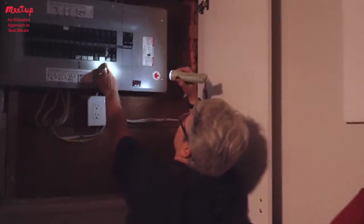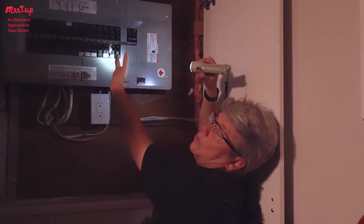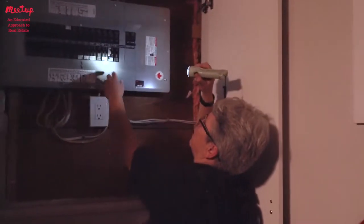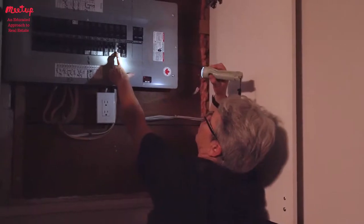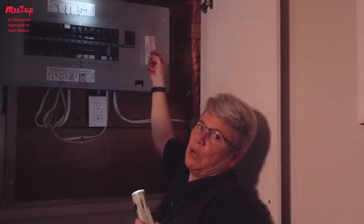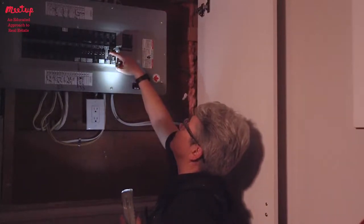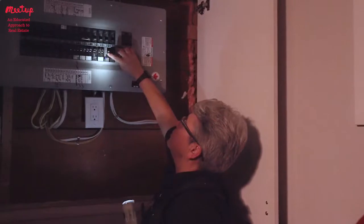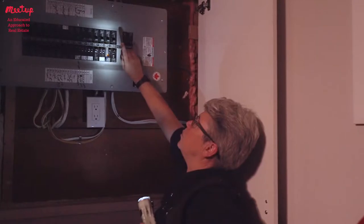You have what's called an arc fault circuit interrupter, or AFCI. This has been installed because work was done on the house — it's been added. It's like a ground fault breaker, but for arcing. If there's a broken wire sparking across a gap, it will shut off. To test it, you press the button, then to reset it you have to go down and then back up — you can't just flip it straight up.